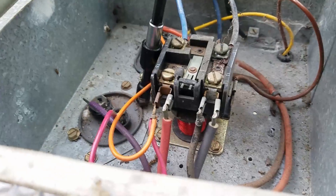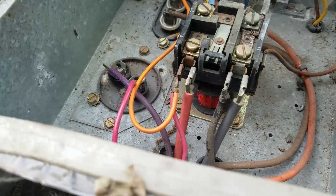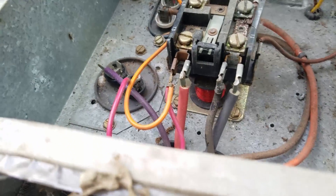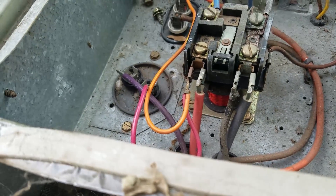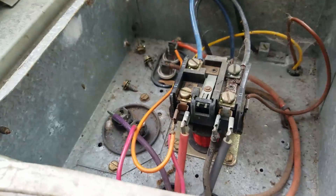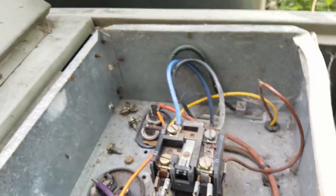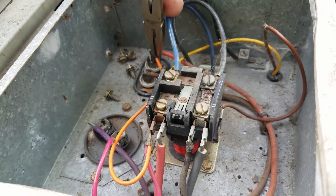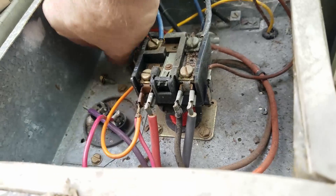This particular air conditioning system has two separate capacitors: one is for the HERM — the hermetically sealed motor, basically the compressor — and the other one is for the cooling fan. The HERM is almost always the bigger one; this one I think is about 30 microfarads and the fan is about 5 microfarads. Then it's just taking the screws out, blundering through things, and figuring out that I should have left some hardware in to pull the connections off the pins.